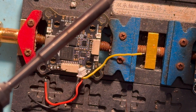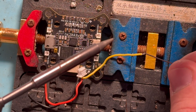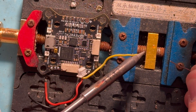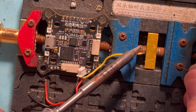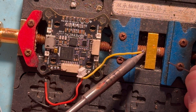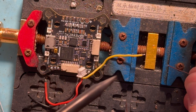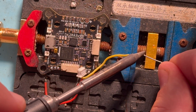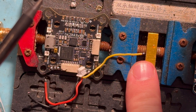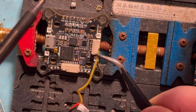Make sure you have a clean tip, get a little more solder on the tip, and then I like to just touch it to the wire end. One of the biggest mistakes people make is that they don't have solder either on the wire they're about to attach or on the pad itself, and if you don't have either you're gonna have a bad time. You're looking for that nice little shine to it — just like that. Now we've got good solder on here.